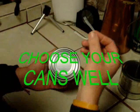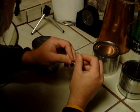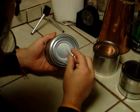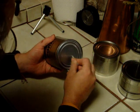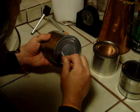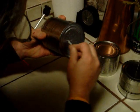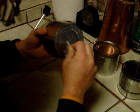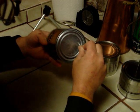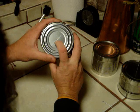Here's a good way to find the center. You take a nail or a screw or something that's pretty close to the deal. I take this bottom part to here and come across here like this, and I turn it. You're going to find that by doing this it's scratching it. You tell by the light — it all intersects in one little spot right there. That's your exact center.